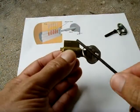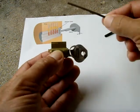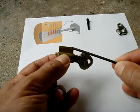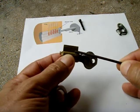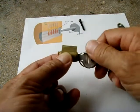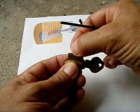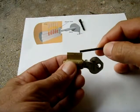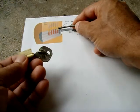Now, some lock cylinders, this top edge here, in here there's the springs pushing down, like the image over here, on a set of pins. So you have springs pushing pins, and you're also pushing on the lower pins, which engage the key to create the shear line, which allows the lock to rotate like it is right now. Now, some of them you could pop off this, it'll be like a chrome or a stainless little cap you could pry off, and then all the springs are going to come out. You're going to have five holes with these yellow pins coming out.